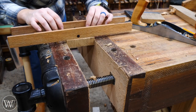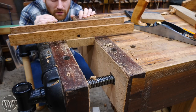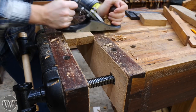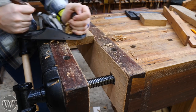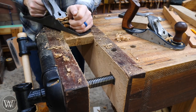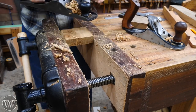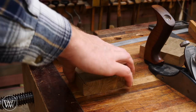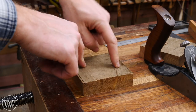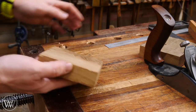I can check these with winding sticks, but really on something this small, just a straight edge running from corner to corner and then across both directions, you can tell if it is flat fairly easily. I'm going to smooth it down and work with a few different tools until I find the one that's actually working well at this time with this figured grain that's going in all different directions. Different planes were working well and others were not. I can make sure it's perfectly flat, ready to go, and then we can work on the other three sides of these two blocks.